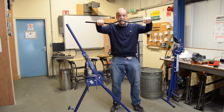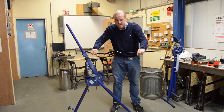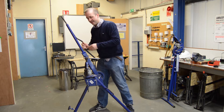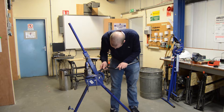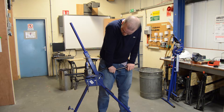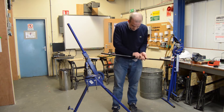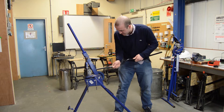And there we go. As you can see, I've overbent that slightly. So what's the next thing we do — we correct it. In this instance, we correct it by putting it in our vice and using our weight, which I admit some of you haven't got the same weight as me, so you might struggle with this, until it's flat. Well that side looks better; we just need to repeat the process with this side.